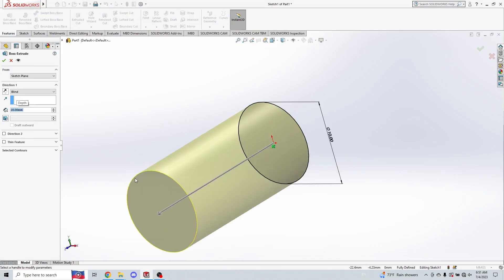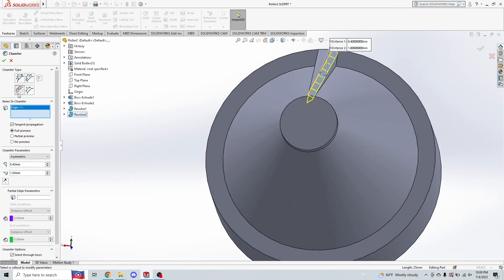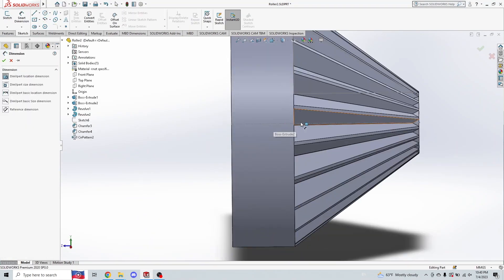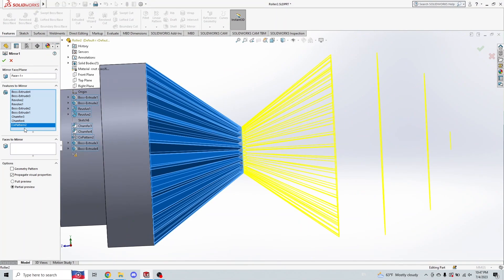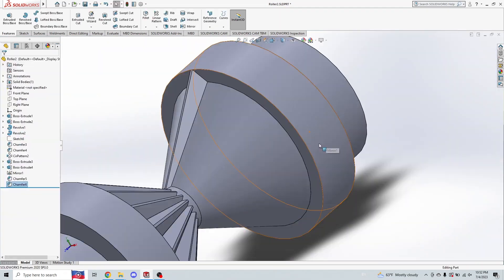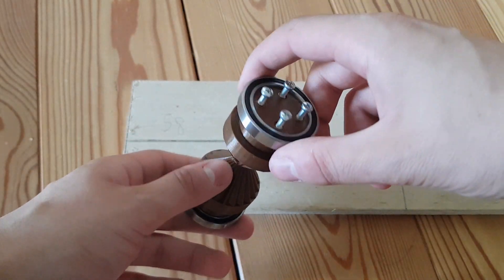So what I want to do is something similar to this cable stripper. I will start by designing the roller — the idea is that the roller has these teeth which press and push the cable while stripping it. Outside I leave a step for a bearing to put on it, and on one side I make four holes for threaded inserts. I made this part and yeah, I know it looks god-darn nice.